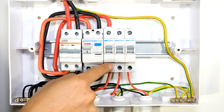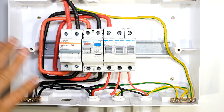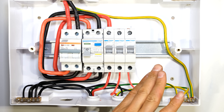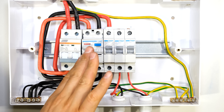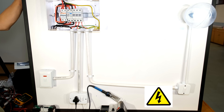I've now allowed current to flow to my boiler or stove, my plug circuit, and my lighting circuit. The DB board is now feeding all loads. If I drop the earth leakage, all my loads are disconnected. If I lift the earth leakage and drop the main switch, everything after the main switch is disconnected, meaning all loads are disconnected. Everything is now connected and switched on.